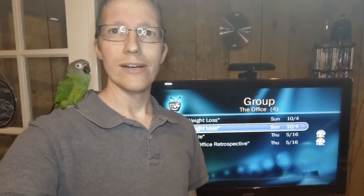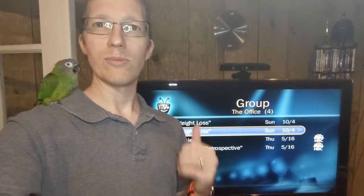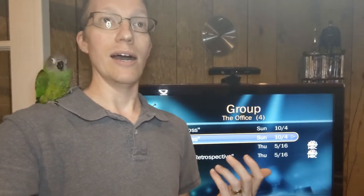I think it would be best to replace all nine of those, but I'm not going to worry about that right now. Maybe I'll go back in this weekend and replace the rest of them, just so the old ones are gone completely — that way it should be good to go for a very long time. Got this back in 2009, so it's already gone 11 years. It's not 4K, but it is high def and records a lot of stuff. We've been using it for a long time. The new ones are cheaper and maybe a little better, but for basically three bucks plus shipping I got this one working again. And for about 20 bucks all in, I could replace all those capacitors and probably get a lot more life out of it.